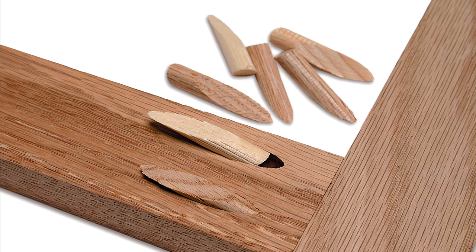You can buy plugs to actually fill it, and you can also fill it with wood glue and sawdust, regular wood filler, paint over it — that kind of thing. But that's what got me thinking: what if I could use the tip of bevelling up a little bit of wood, do your pocket hole, and then glue that bit of wood back down.